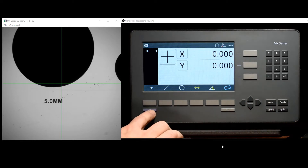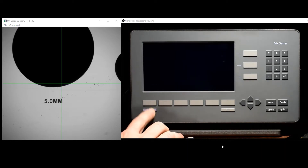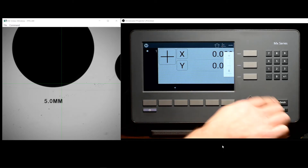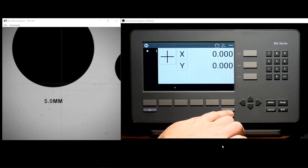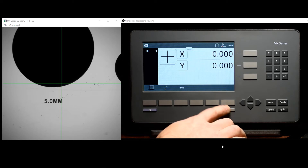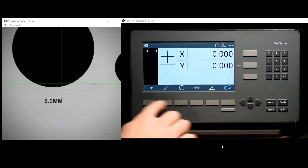In the bottom left of the keypad, you'll find our screen on/screen off button. A single click turns the screen off and on quickly, and a long press brings up the menu to shut down the DRO. Here in the middle, below soft key number six, is our menu key. The menu key allows us to cycle through additional options that can be executed using the soft keys.